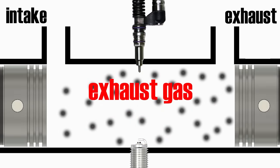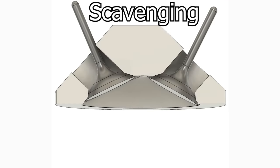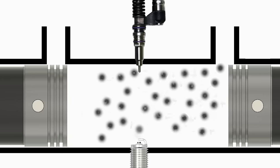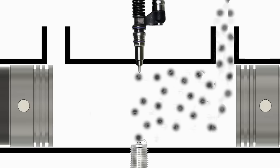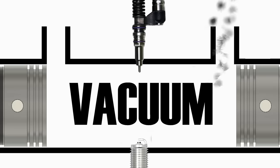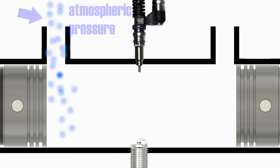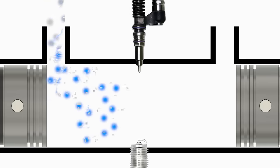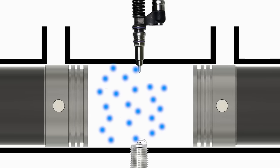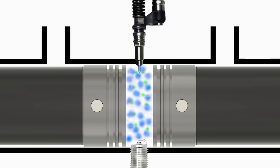So how do we prevent exhaust gases from escaping through the intake? We do this just like in a traditional engine, by relying on scavenging, which occurs when both the intake and exhaust ports are open at the same time. The exhaust port likely gets uncovered first, allowing pressurized exhaust gases to start escaping from the combustion chamber. Since they are pressurized they escape rapidly and leave a vacuum behind them — at lower pressure than the intake charge outside at atmospheric pressure — which means fresh air rushes in and fills the combustion chamber. The upward-sloped part of the wavy thing then pushes the pistons back up, closing off the intake and exhaust ports, and compression begins. The injector adds fuel and soon we have a compressed air-fuel mixture ready for ignition.